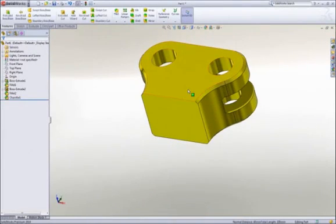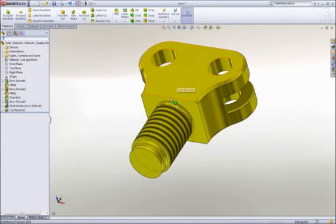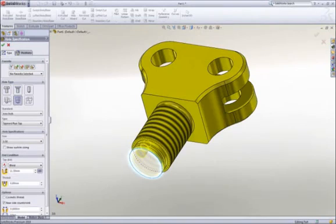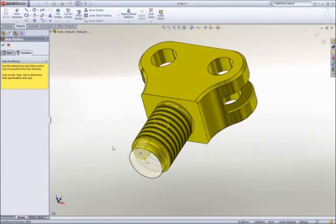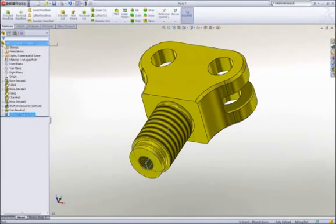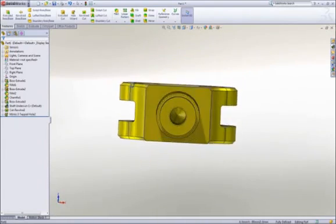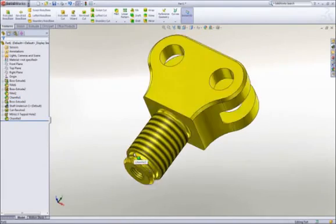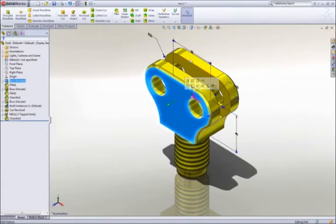Now that you have the hang of it, we will jump ahead a couple features and add a tapped hole at the bottom using the hole wizard. Gone are the days of looking up hole data, because all of the hole types, standards, and hole sizes are available. Choose the hole parameters, locate it, and SolidWorks takes care of adding all of the proper information to define the hole. Let's leverage our previously created chamfer by dragging and dropping it onto the bottom edge to make a copy. The part looks good, but maybe a couple of changes would help to refine it.